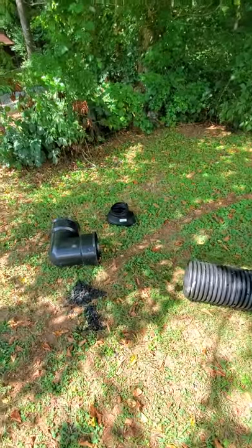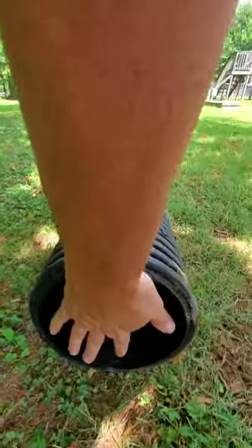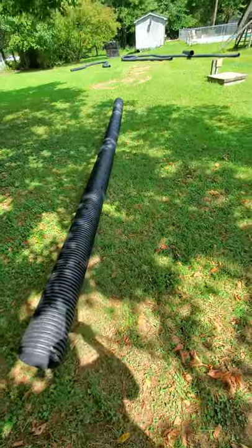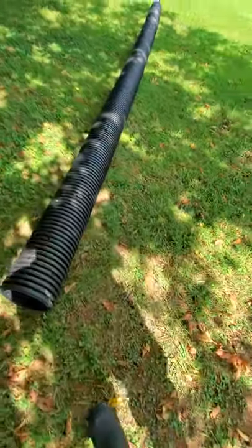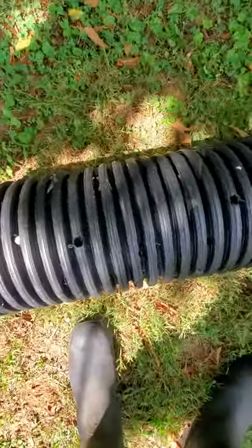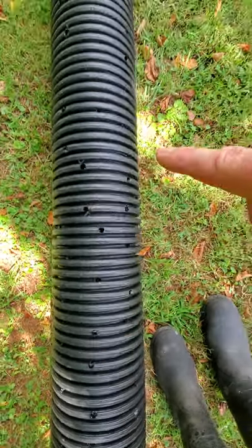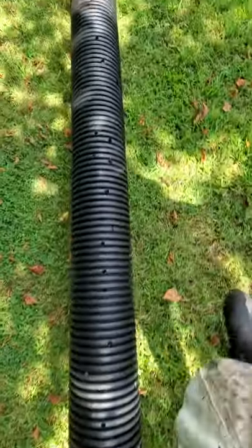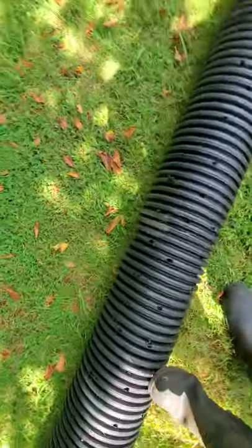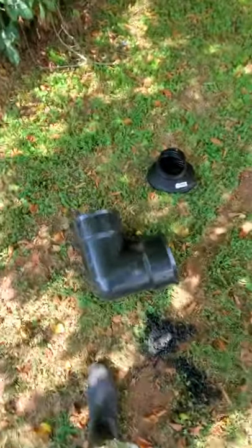This is my eight-inch pipe. As you can see, it's pretty big pipe — this is gonna be the one to go on the front wall of the house. I've got some more pipes out there, but they don't make eight-inch pipe with holes, so I've drilled holes — all the little holes all the way down this thing, probably a couple hundred of them, all the way around. I used a half-inch bit.